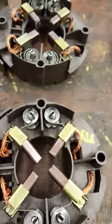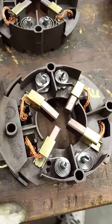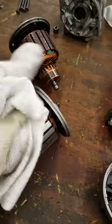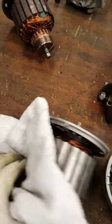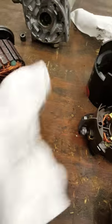When you install them back on the armature, try not to be rough with it. Using a clean rag, wipe down your armature and your winding on the motor. The goal is to get as much dirt and grease off as possible. Also, if there are any metal shavings, you want to get them off because it's not good when you put them back — they will cause problems.